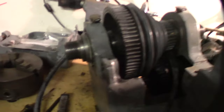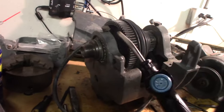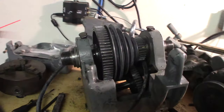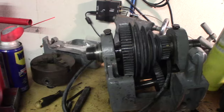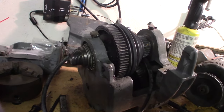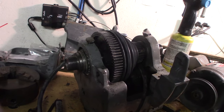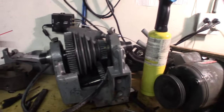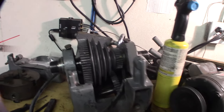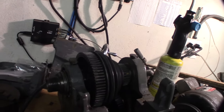I'm worried about breaking this thing, so I'm going to hit it with a torch - just a little bit right in here. I don't know the melting temp of this material exactly, but it's aluminum-magnesium, so if you heat it up too much it's going to turn into liquid. With a gas torch on aluminum it's like - you have to be careful, that's why you typically TIG weld it. It'll basically liquefy in two seconds if you're not careful.